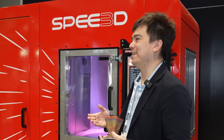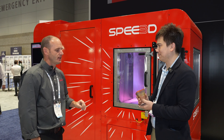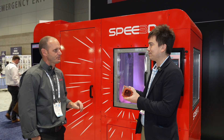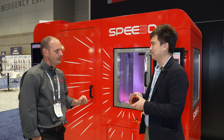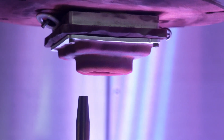Do you run into problems if the powder is accelerated too fast? It can impact the shape of the parts and create residual stresses inside the part. There's a lot of process optimization that goes into defining the powder specifications — we can adjust temperatures and pressures to optimize.